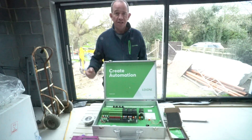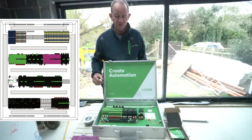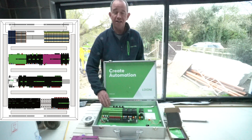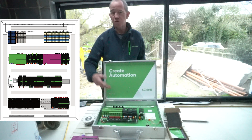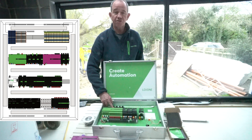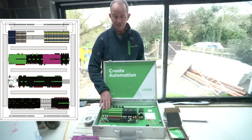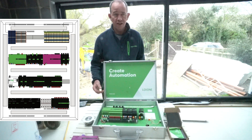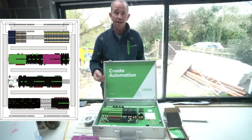I'll put up a diagram of my current draft panel design that Hugh at Thames Valley Automation has put together. We're still fine tuning it, but it has the basic Loxone mini server — the brains of the system. It connects via ethernet and is managed locally; it doesn't need cloud control. You can configure and manage it remotely, so I can do some of the programming myself or Hugh can connect and make changes. It has eight digital inputs, four analog inputs, and eight relays, plus connection to Tree — the cabling protocol used by Loxone, similar to CAN bus with a 24V DC bus and data bus connecting to devices around the home.